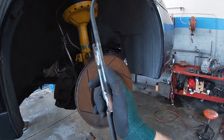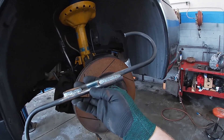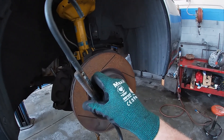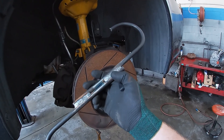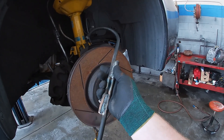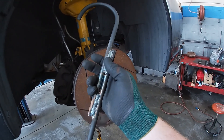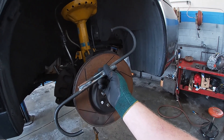I'm going to show you two different methods of making these. The first method is if you have a welder — you can just weld the two together and you're good to go. If you don't have a welder, you can use hose clamps. You take the two threaded ends, interlace the threads so they don't move, and put two hose clamps on either side.